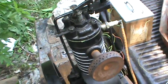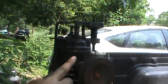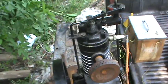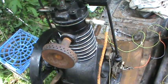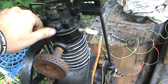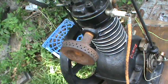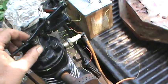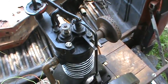This is a compressor, so there's no combustion chamber. I had to make a spacer — there's about a one-inch spacer between the head and the block. The Curtis, for whatever reason, uses the air passage in the block, so I had to make a passage from the head into here through this little block and through the exhaust. I had to modify the original head quite a bit with this exhaust valve here.